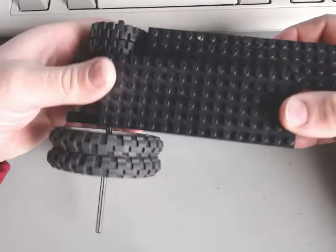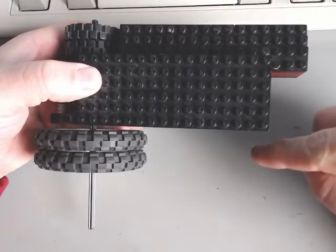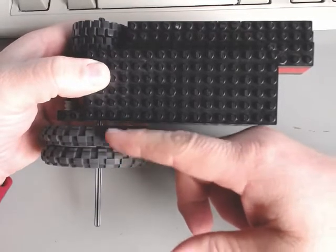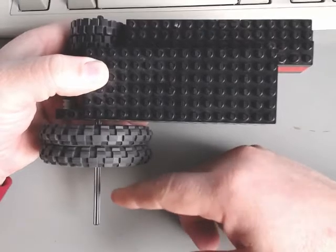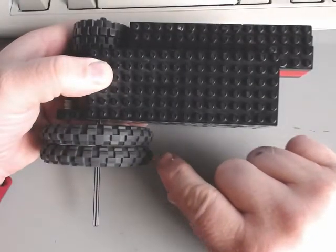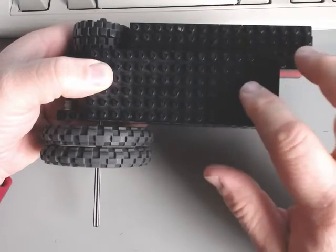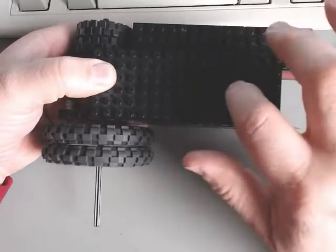My next version of engine I would like to build is this one with a manifold on this side, and of course that will cause problems with the flywheels getting in the way, so they'll have to be located out here. But the idea being that one side can be pressurized and the other side can have a vacuum, and that creates a situation where this is already dual acting, but it only works by pushing on the piston back and forth.